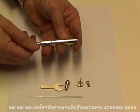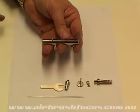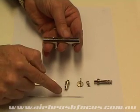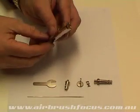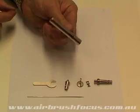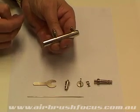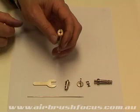I can take the trigger out and take the back lever off. So, what we've got so far is the head and the needle, the trigger, back lever and rear spring assembly, and that's basically the body is now stripped down except for the air valve, which we're not going to be working on. We're not going to be taking anything off that section there. We're only going to be working on the internal seal.